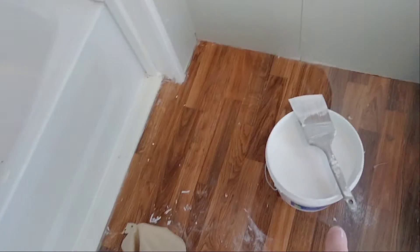You run all that like I showed you in the previous video, then you take drywall mud and go over that. Now I'm good enough that I don't have to sand the caulking, but I would suggest sanding the caulking before you go over it with the drywall mud. In any case, make sure it's all good and sanded, and then prime it with this primer.